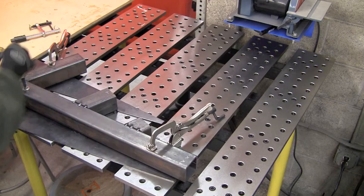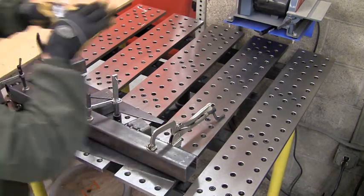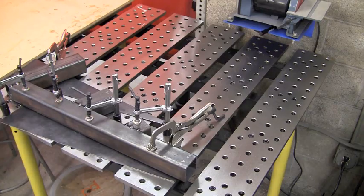The table makes it go fast and the clamps work really well, though they do get in the way a little bit — they tend to block things with the riser and the handle, so you've got to make sure you've got room. Here's one of the welds — we put a shade on the camera just to try and see what we could get. You can kind of get the idea of what we're doing: just a real quick stringer bead on these butt joints, filling up that gap with a weld. We're not going to over-weld this thing; we just want to keep it together and nice and flat.